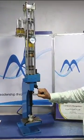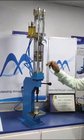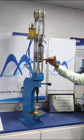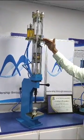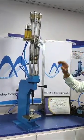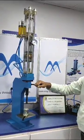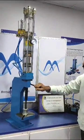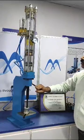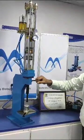This is the power stroke now. We will retract the cylinder — the power stroke is released, the approach is released, and the reservoir oil has gone back. This is the return position of the cylinder. We will quickly see the cycle again: this is approach, this is power stroke, and this is retraction.